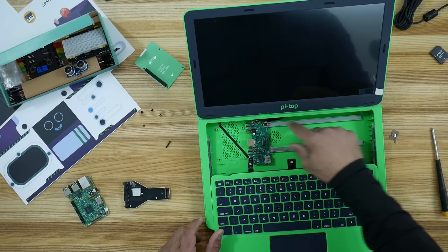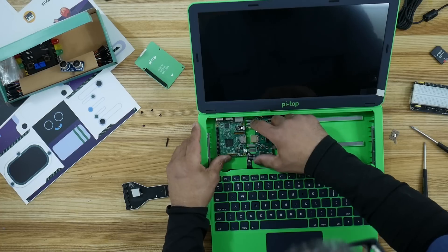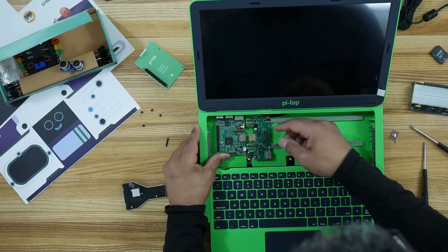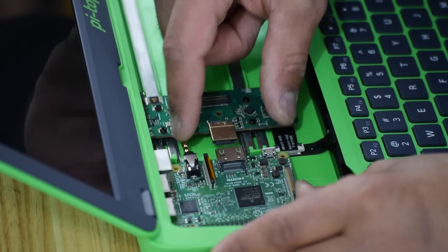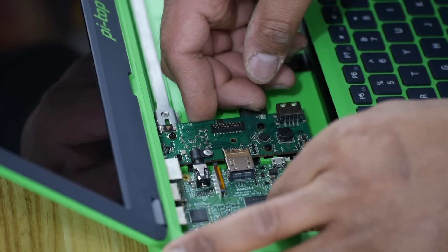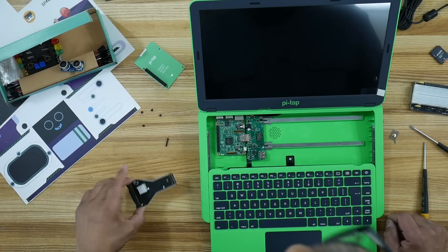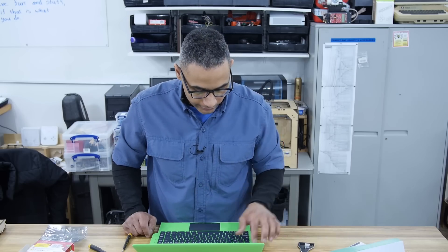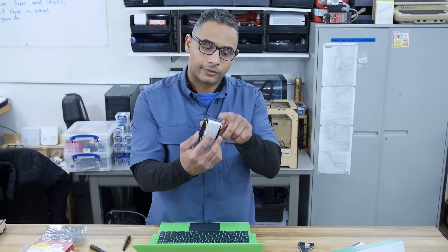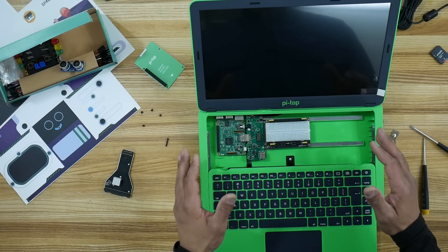The rail system was a little more complex than this last time. Next we'll take this hub — it has an audio AV jack and HDMI, so we just plug that in here. That's going to supply power and give us HDMI, and then when we put the cooling bridge on there it'll expose our GPIO over here. There's a little header which connects this, and then we have the GPIO on our breakout board.